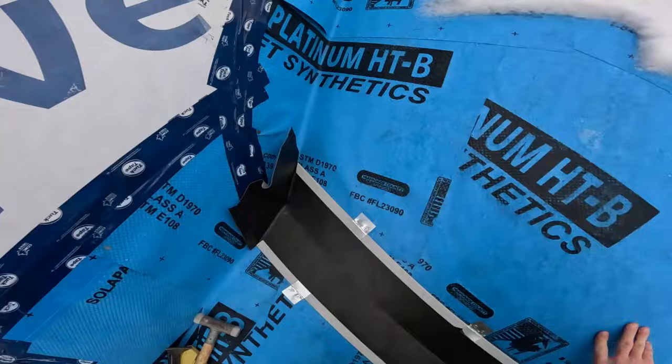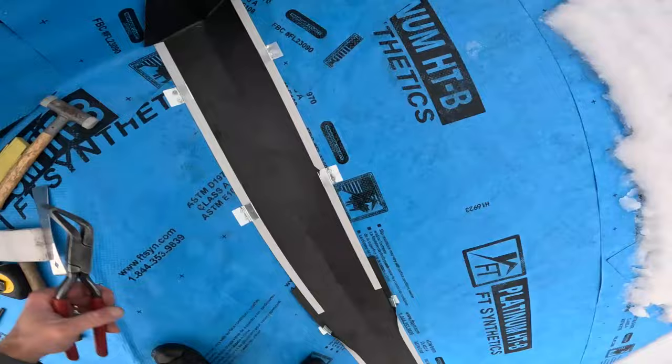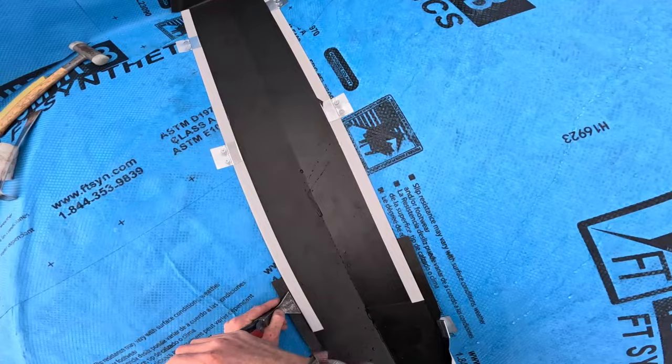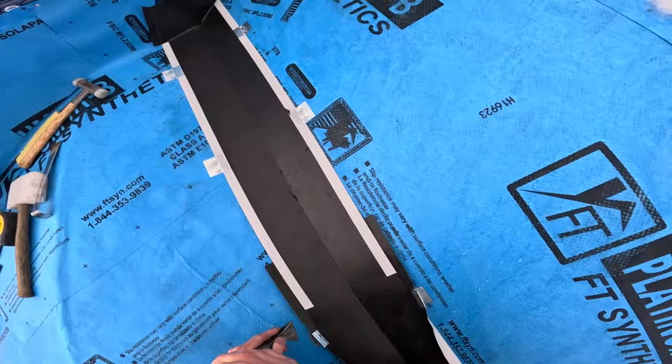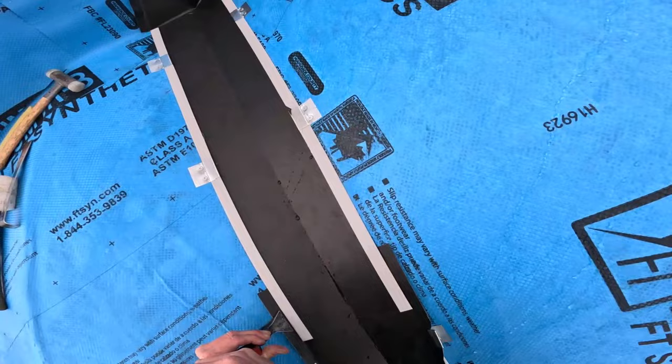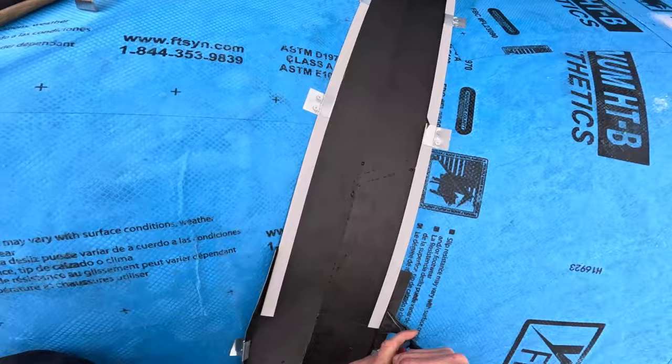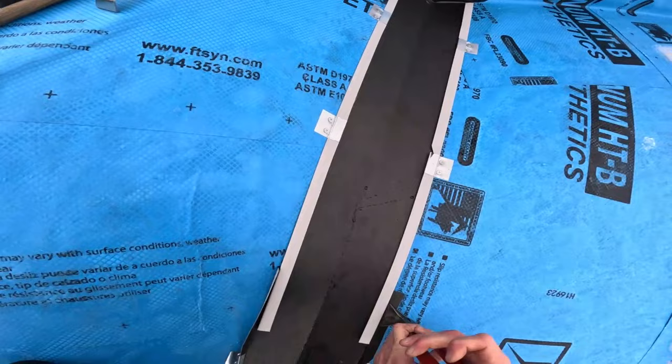Okay. So because it's stationary, I'm going to show you how I close this in, because I'm not notching anything. I'm grabbing and I'm bending in front of the valley. So when it does get knocked over, see how I'm about an eighth away? I'm about an eighth away from this valley here. If it doesn't hug it tight, it's okay. What's of major importance is that it's curling over it with a substantial amount of metal. So I'm about an eighth away,